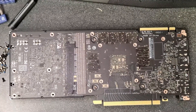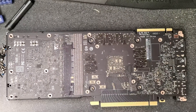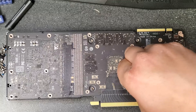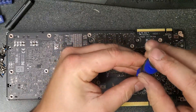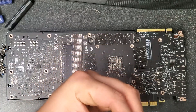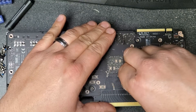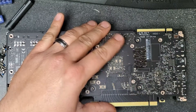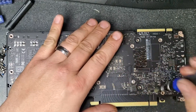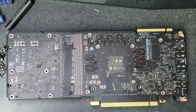We're going to start reassembly with the four millimeter bolts — get your socket or bit, and with your fingers strategically start threading them in. With large hands it's a little difficult, but make sure you do not cross-thread them because that would really be bad. Use the very tips of your fingers — maybe grow your fingernails out for a week so you can grip them better. Thread them in by hand first, then put your driver on and drive them in snug. You don't want to crank them down and break something — just snug.